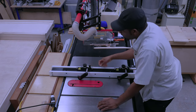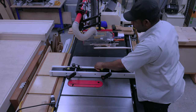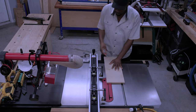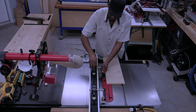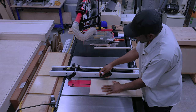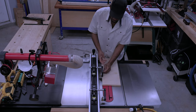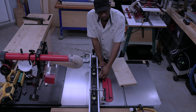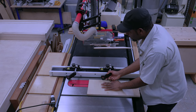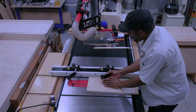What it allows you to do is have an adjustable anti-kickback device. You move it anywhere along the rail. I generally keep one after the blade and one just before the blade. When it's set up correctly, you loosen it, let this smooth metal surface drop on top of the stock. It has a spring, and the wheels sit a little bit lower than the surface, so when you engage and set it, the wheels are at the right height to apply the correct amount of pressure. Make sure the fence is locked down.